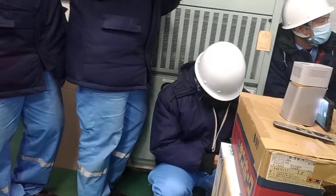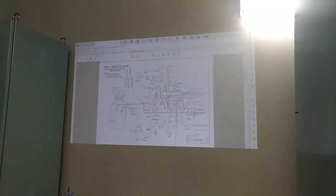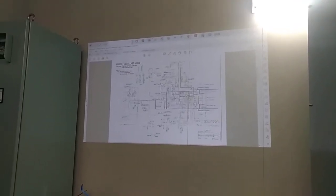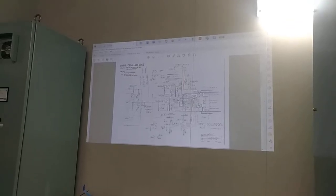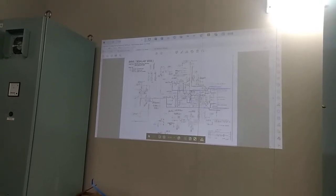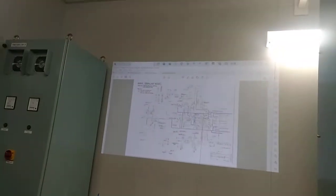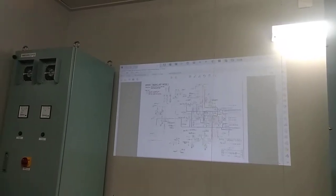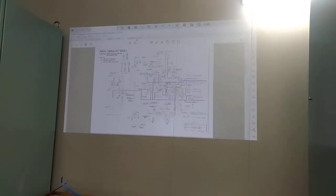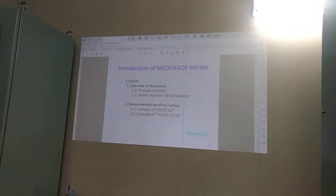Ballast mode. So this is the piping diagram. And then next, we have the de-ballast mode. Same as before, from your ballast tank, it will be pumped out using your ballast pump, going to overboard. But before going overboard, you have to apply the neutralizer, the chemical. This is automatic. The manual is you only put it on the hopper. You will see that downstairs. How many kilos depends on the computation, so we'll discuss that afterwards.